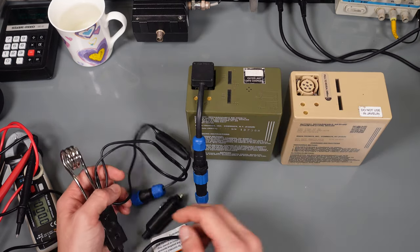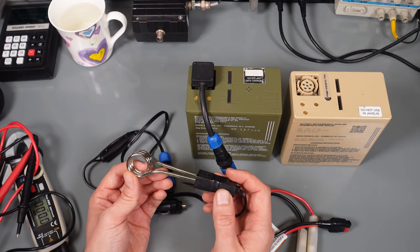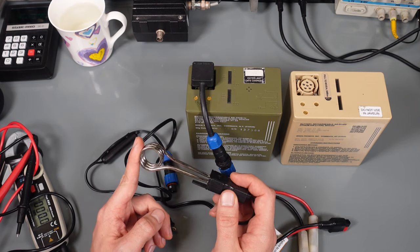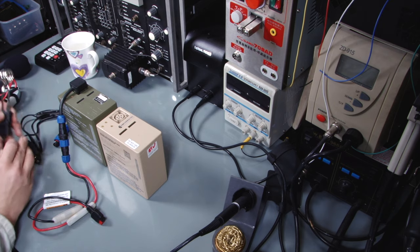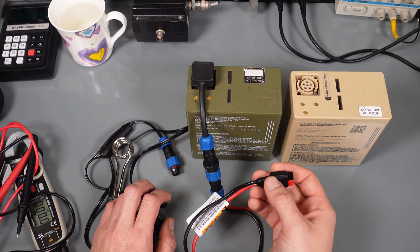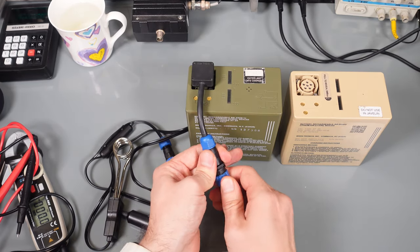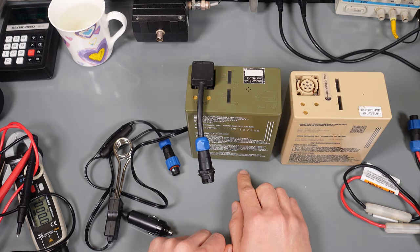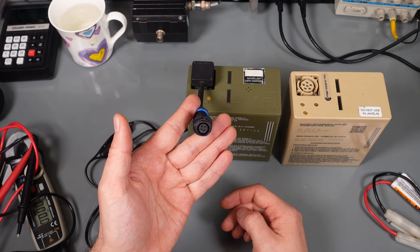But over here, I've got a 24 volt car heater, and this makes a lot of sense because the higher voltage is going to deliver much more power at the same current and boil our water faster. But the question is how we can pull 24 volts from the system. As you can see, we've got 12 volts at the end, and the magic of those military batteries is that they've got two strings of 12 volts, and your personal decision is what you want to do with it.